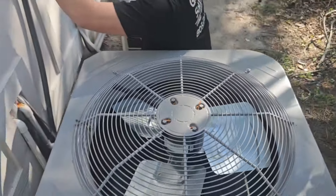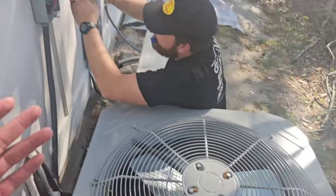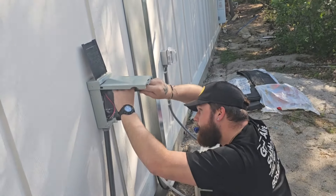For now, we're going to bypass the disconnect — wire nut it all together just so we can test and verify everything is working. I know it's not what we're supposed to do, but the homeowner wanted us to do the startup and get the system working. We'll verify the wiring, pressures, make sure the system's still full of refrigerant with no leaks. Then we'll tell the homeowner he's got to get the electricians to come back and correct their issue.